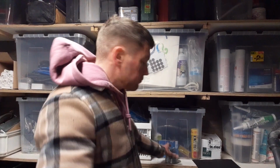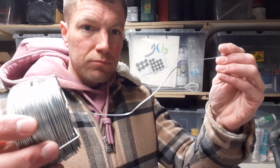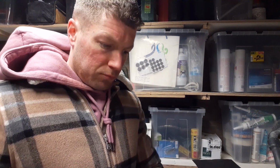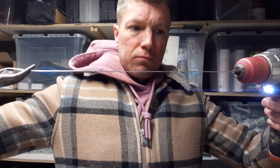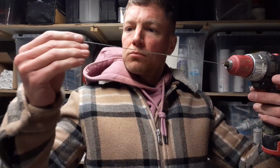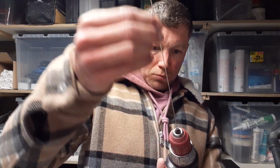Now the 4 layers are done, it's time to stack them. For this I first make some columns out of sturdy wire. I get some binding wire from my garage of a diameter of about 1 mm. Unfortunately the wire is pretty mingled, which could result in an ugly cube. To fix this I work harden the wire by clamping one side with pliers and putting the other side in my battery operated drill. This creates torsional deformation, straightening out the wire and even making it a bit more stiff. My facial expression might not show it here, but I was actually pretty surprised to see how well this works.